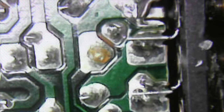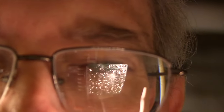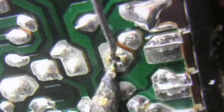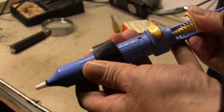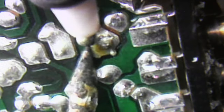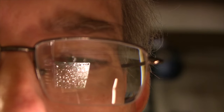This joint for one of the relay coils is cracked right near the output pin. Before reflowing the joint, I'm going to apply some soldering paste — this should help against the corrosion that's already there. A steady hand and sharp eye will get this done fast. I no longer have either, so I'm going slow, taking my time, and removing any excess solder so I don't accidentally bridge anything.